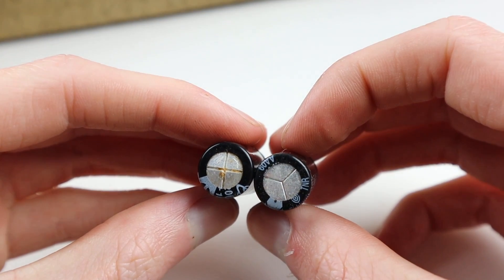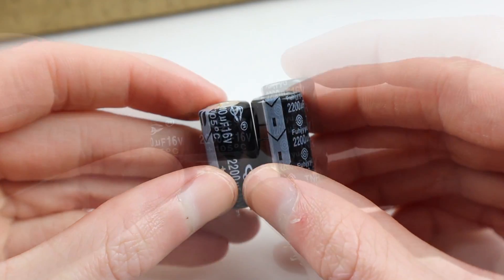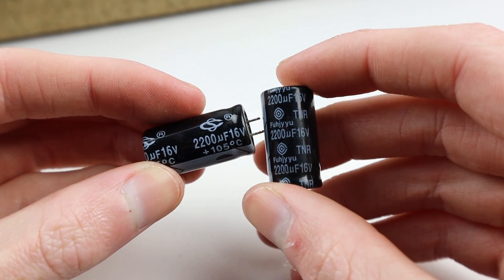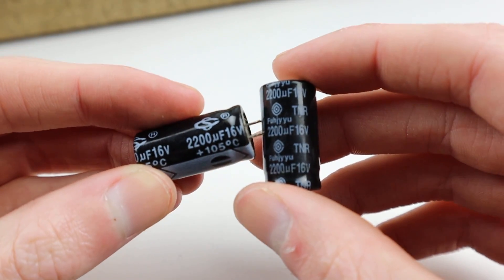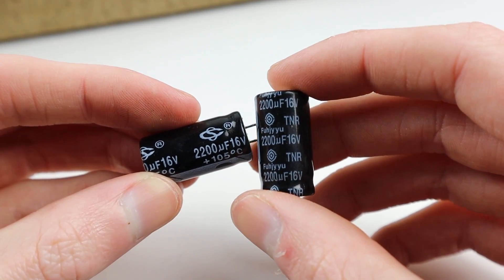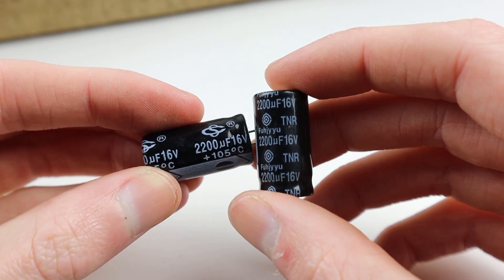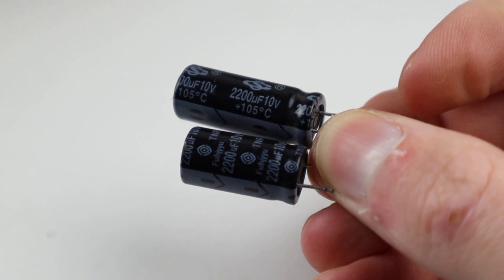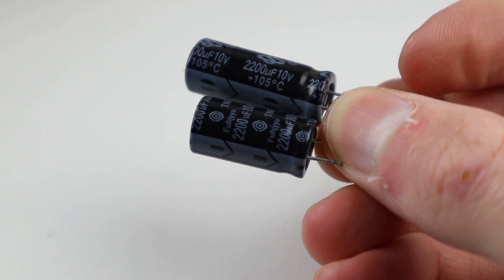I've matched these with replacement ones that are actually used — I salvaged them off of damaged electronics, so hopefully they will work in this power supply unit. You can slightly increase the voltage rating if need be, but you can't use a lower voltage cap as it can be seriously damaged if used with the incorrect voltage.